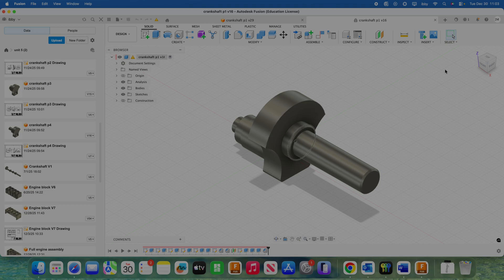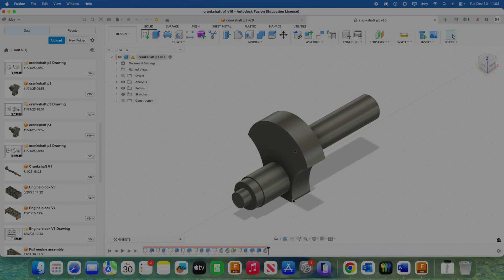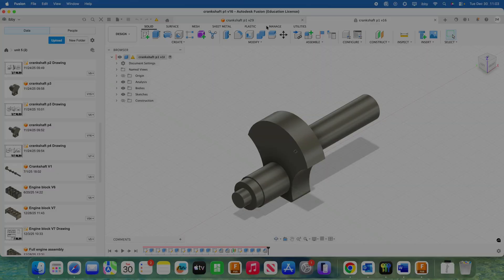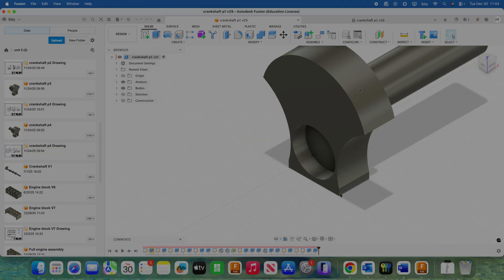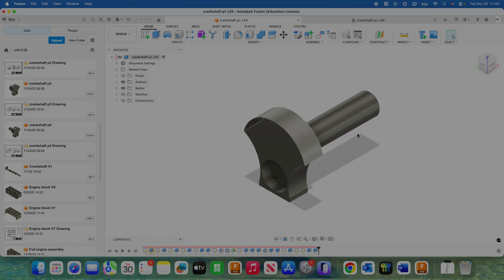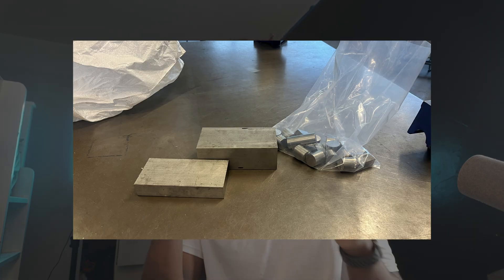The main thing I needed to show you was the redesign to the crankshaft. A lot of the time I've been designing without any regard to how it's actually going to be manufactured — putting in crazy tolerances and crazy designs, just trying to get it to work. But when I started manufacturing, I realized it's basically impossible to do that with the school's resources. So I redesigned it, separated some components so I don't have to offset the lathe, and simplified things — all while keeping the function exactly the same, constrained to the metals I'd already ordered.